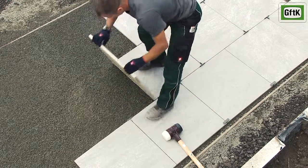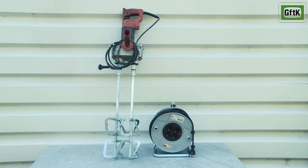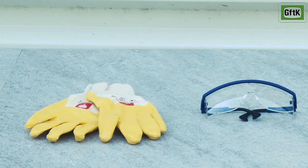Professional installation is a requirement for solid grouting. For a professional, easy and quick application of VDW 815 Plus Mortar, you will need both a water and a power supply and a suitable twin paddle mixer with counter-rotating paddles. Furthermore, a long hose with a spray nozzle, a rubber squeegee as well as a clean coconut fibre brush. These tools are available from GFTK. Please make sure you wear protective gloves and protective glasses during the application.